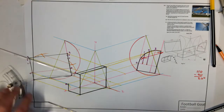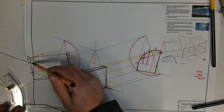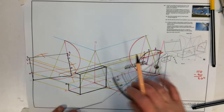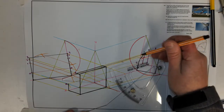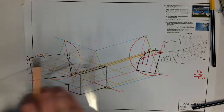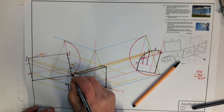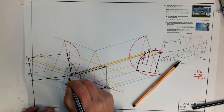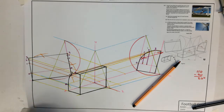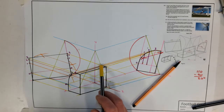Writing the numbers on the points as you go is critical — 0, 3, 2, 1 — and the same is done on the other side, though a slightly different method may be used there. Bringing down the points in orange. Point two-and-two crossed gives one location; point one-and-one crossed gives another. The shape of the curve is now established between those crossing points.